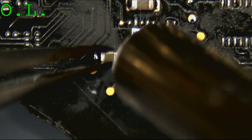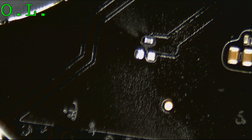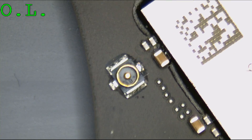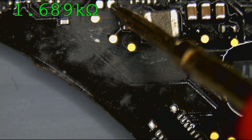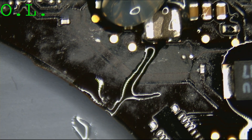These caps go bye-bye, and once these two have both gone, I should definitely have something better than 100 ohms to ground. We're going over a kilohm. Bad diode. Bad capacitors after the diode. Bad ISL9239 since we weren't even getting an enable signal — this board had a little bit of just about everything.